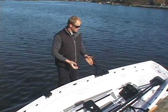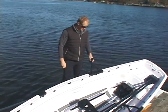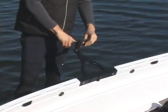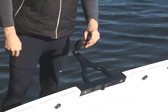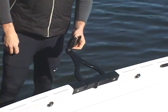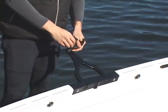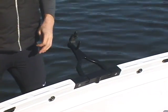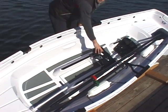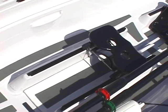Before we go into the details, I'm going to introduce some of the equipment we use in the boat. You can see the boat is equipped with an outrigger. It has an oar lock right here that swivels, and the oar lock that comes standard with the Whitehall boat has about a four degree pitch. If you're wanting to adjust the pitch, you can buy an oar lock from another manufacturer like Concept2 and it's easily fitable on the pins here. You can also see we have a sliding seat — the seat moves back and forth so that you can use the biggest muscle groups in your body. That's your legs.